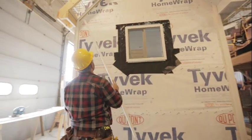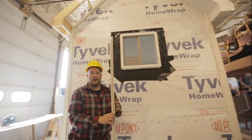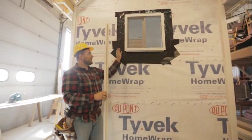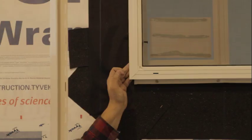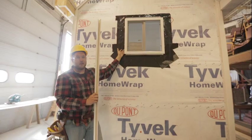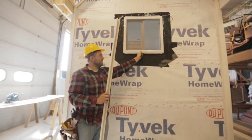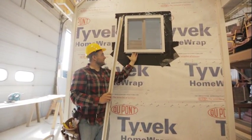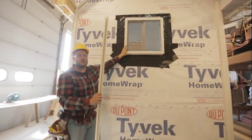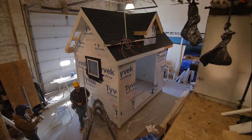I have one piece already installed. I want to quickly talk about doors and window openings. A lot of windows nowadays have pre-installed J trim on them, so these windows are already ready to go — we don't have to do any more work to them. Your siding can just slip right up underneath and on the side of it. I'll show you a door in a minute, but before we do that, we'll go ahead and finish off our soffit here.